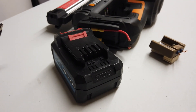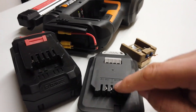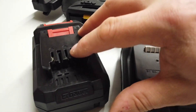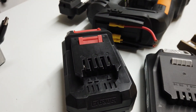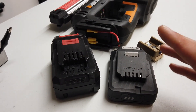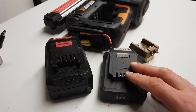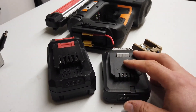I then took a couple of batteries and started looking at different batteries, trying to figure out which ones have got this extra thermal sense line in them. Some of them have got 'ID' written alongside it as well, and this one has 'D' written alongside it, which scares the poopy out of me. I thought perhaps they might be data - perhaps when you plug in a battery now, things have got so complicated that it basically does a little bit of I squared C data bus chatter and tells you if it's an original battery and all that kind of stuff.